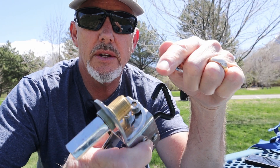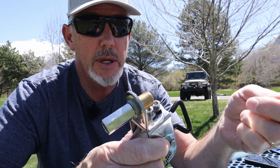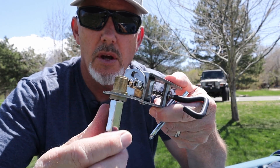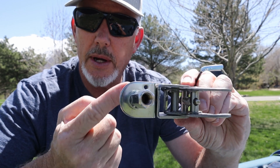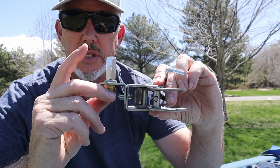On this end I've got the Allen screws, which will keep this bracket from moving around and keep it in the spot you want. When you loosen up the end screw, this will let you rotate the bracket horizontally and vertically. The coax is going to fit here and go down, so now you've got this mounted on a pipe with your antenna vertical.